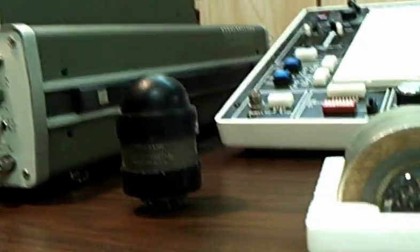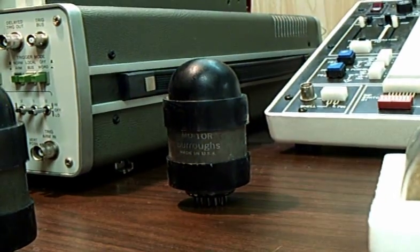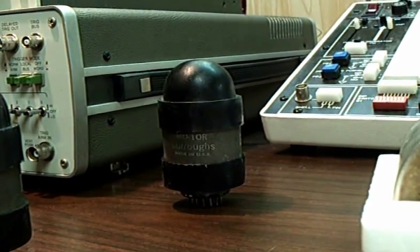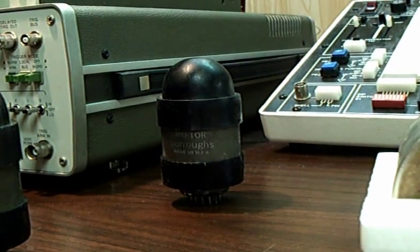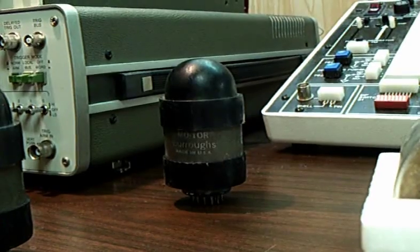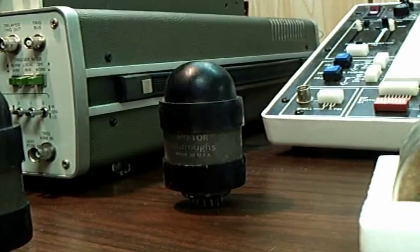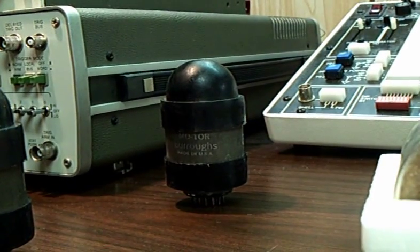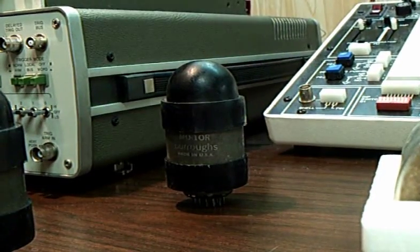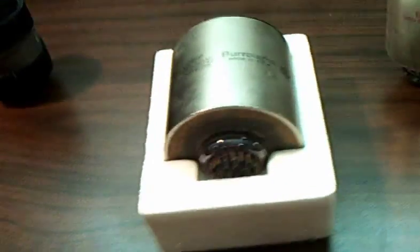Right here, that one right there that looks almost exactly like a 6700 — that's an MO-10R. That is the world's fastest counting tube. It counts at 10 megahertz. It accomplishes this because it has resistors built into it that reduce the lead capacitance on certain components inside it and give it a faster counting speed. There's another model of 10 megahertz beam switching tube called the BD-309 that came out a little bit later, and it's basically exactly identical to an MO-10R but it has a shield much like this guy right there.